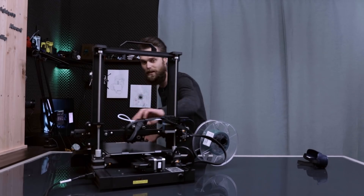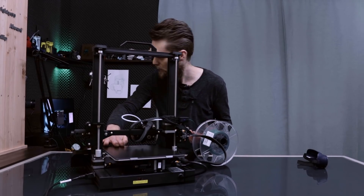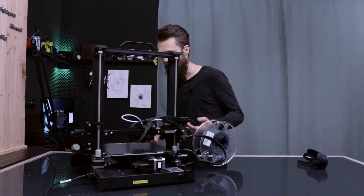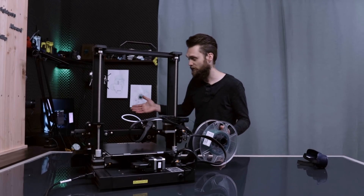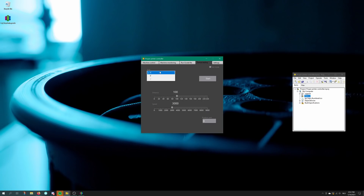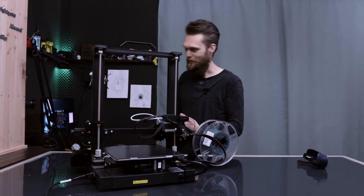A feature that I think is pretty handy is to disable the steppers so I can move all the motors again manually. I can monitor the machine — it monitors the end stops. If I push the bed all the way to the back, you will see that the end stop will be triggered. It monitors the temperatures, so if I'm set to preheat PLA, you can see that the set temperature and the actual temperature are shown within this graph. I can change the speed so it updates faster, and it's also possible to stop the monitoring so the communication between the computer and the printer is faster.